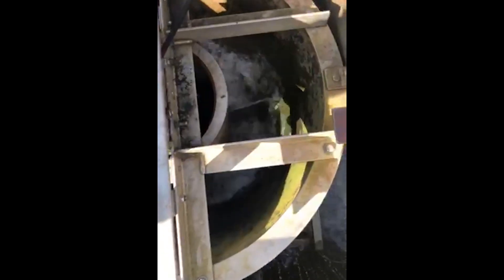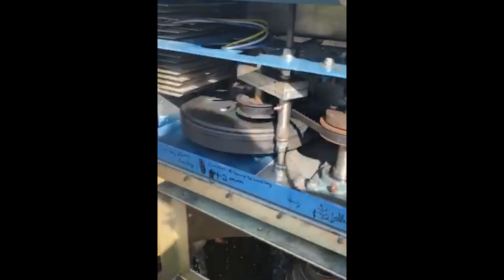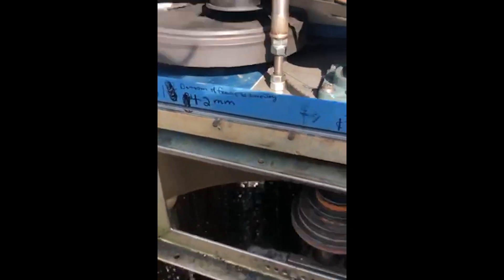He's shooting for around 500 gallons per minute continuous flow, falling about eight to nine feet — it really depends on what water levels we achieve. We're going to transition it to an inline impeller system, which I guess would be called a fixed-pitch Kaplan-style turbine. So you saw the 3D printed impeller I'm going to use, and we're going to replace all of this. He's already ripped it all out and replaced it with a different tube system.